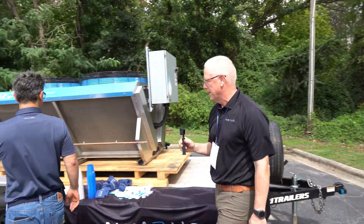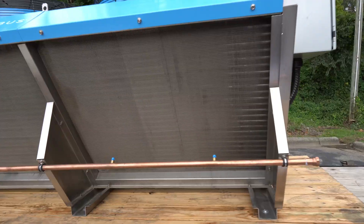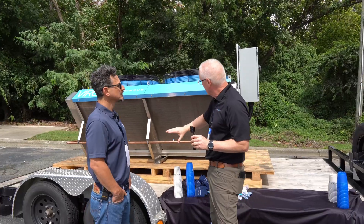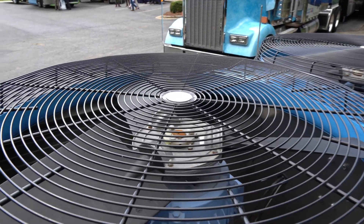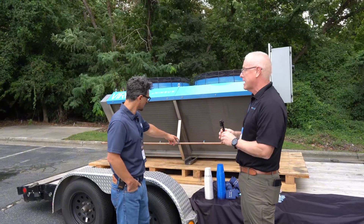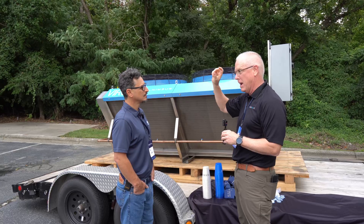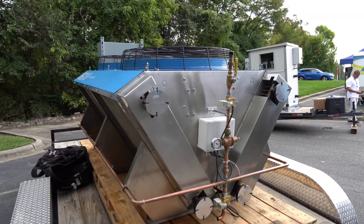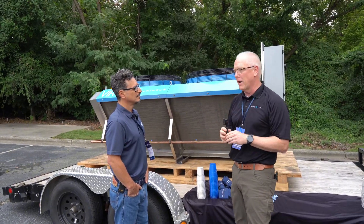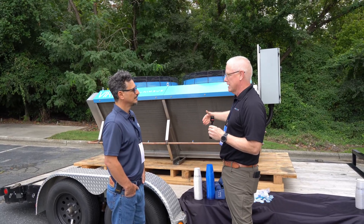Adiabatic cooler — what that means is you spray water on it. We spray water, we evaporate water in the air to lower the ambient air temperature. So what this does is we'll just use ambient air alone for most of the year — draw it in over the fin face and the coils and expel the warm air up here. That's how we'll get our heat rejection. On the hottest days of the year, when we can't do it with just ambient air alone, because it's, say, 95 degrees outside, we'll use a misting spray to get evaporation into the air to change that 95-degree ambient air to, say, 75 degrees. Draw it across the fin face and coils, and that'll give us our heat rejection to get, say, 85-degree leaving fluid temperature. So that's adiabatic — different from a cooling tower in that they're evaporating water and the cold water goes to a basin. We're trying to change the air temperature that's being drawn across the coil.